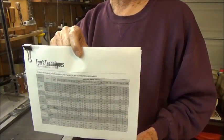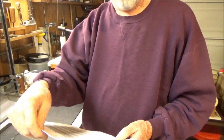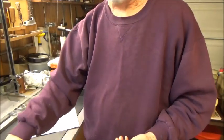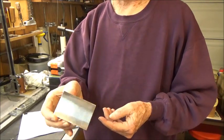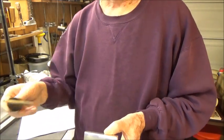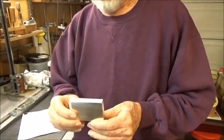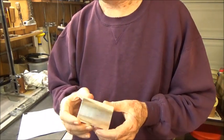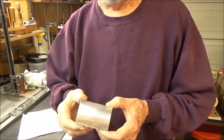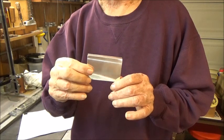I use this for both aluminum and for the steel. He's got aluminum on there, which would include the 6061 that I have. The fly cutter leaves quite a nice finish. This is a piece of aluminum small enough that this fly cutter could make it in one pass. My mill's tram is quite good — I'm not getting anything at all. I get a line, but that's about it. I can't feel any difference between the two surfaces, so the tram is pretty good.